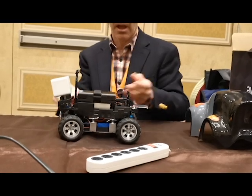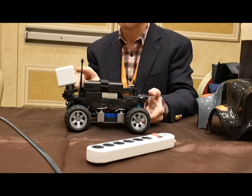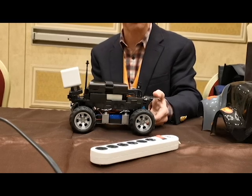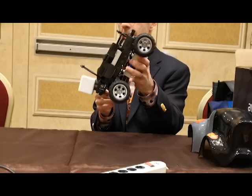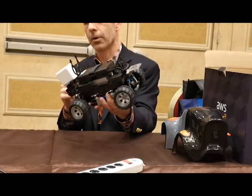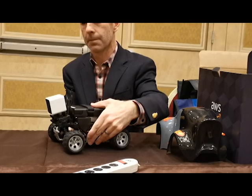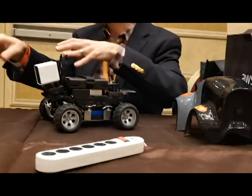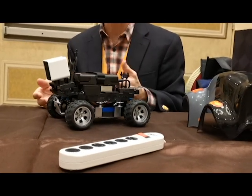The device was built with a single sensor — this camera on the front. This should look familiar if you know about DeepLens; it's the same camera and lens assembly as on the DeepLens. It's connected to the car via USB. You can see through the front ports here there are a few USBs. We put three USBs across the front to enable future expansion — for example, if we wanted to use two cameras and enable stereoscopic vision, which could enable some really interesting driving behaviors down the road.